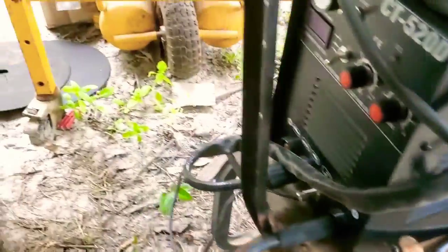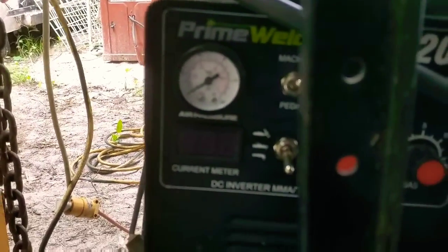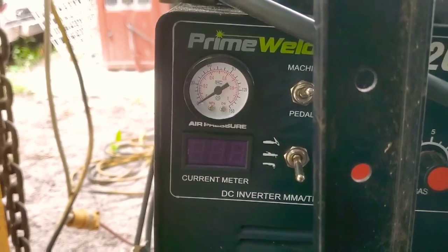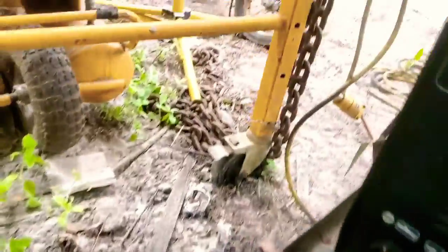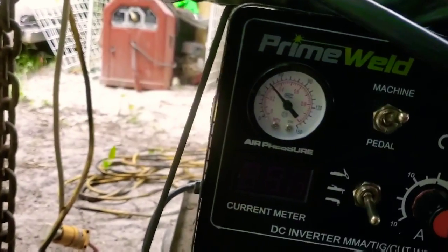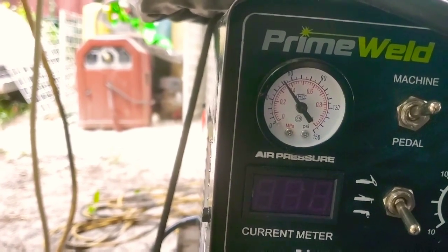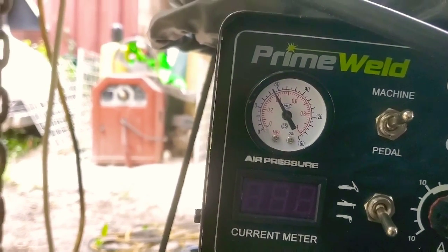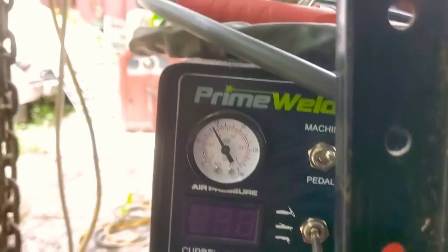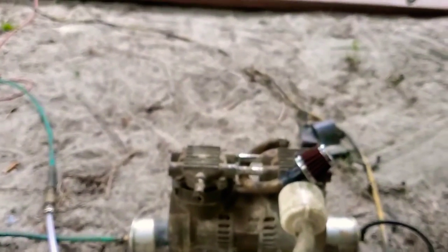If you look right here on the front of the machine — let me get that to focus — right now we're at zero PSI, zero pounds pressure. So I'm going to plug this in. I just plugged it in, and right over here, immediately, you can see how fast the pressure builds up. I'm already up to almost 60 PSI, which is more than enough for what I need. What I do have to do is put a pressure switch on here so whenever it gets up to the pressure that I need, this machine will shut off, because as of right now it just constantly runs.